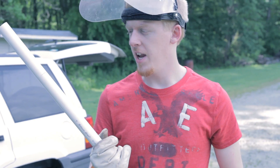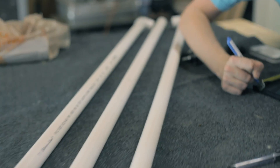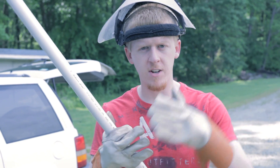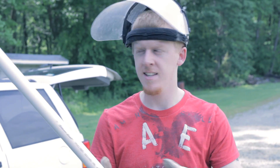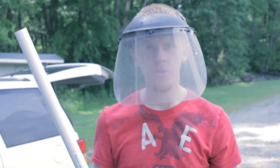That makes a very nice steady roll with our platform. Now we've got to cut a seven inch piece of PVC pipe. We'll take two of these pieces and it's going to connect those two elbows on the two PVC tracks. That way it's going to make a perfect rectangle, so we wouldn't have to adjust it and the platform can just sit right on it — it's the exact measurement between those wheels. We're going to cut two of those now.